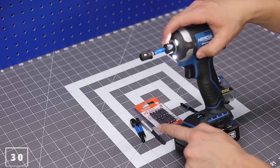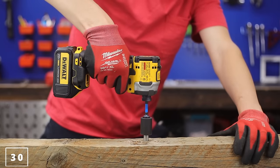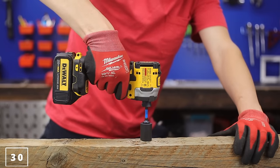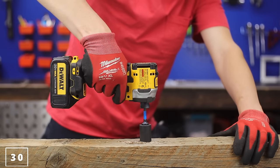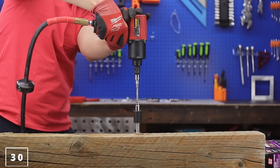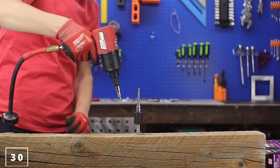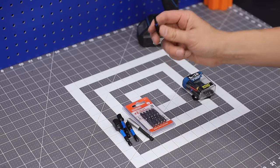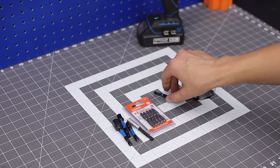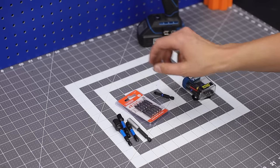Socket adapters and bit adapters — I've had no issues with any impact or other use with even their cheap ones, and that is by using a cordless impact driver. If you're using a big air one that has like 1800 foot-pounds, you'll snap these no matter what brand. I'd almost guarantee that you're stripping your screws not because of the bit you're using but more so your technique. So save a bunch of money, get these, and then practice your technique.